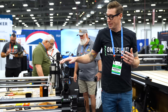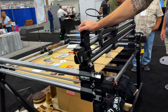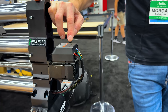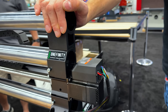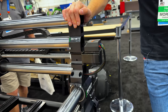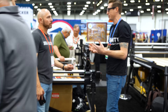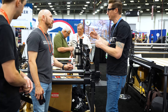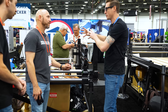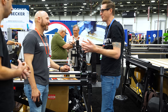These two machines are the exact same, but this one has the sliding table on it. This is our Elite Foreman — it's got a full 48x48-inch capacity and closed-loop stepper motors, which are a game changer. It's constantly communicating with the controller, telling it where it is at all times. So if you have a power failure or anything like that, you can go right back to where you left off and not ruin a carve that's halfway done. If it ever gets off kilter, it'll stop, rehome, and come back to start where you left off.